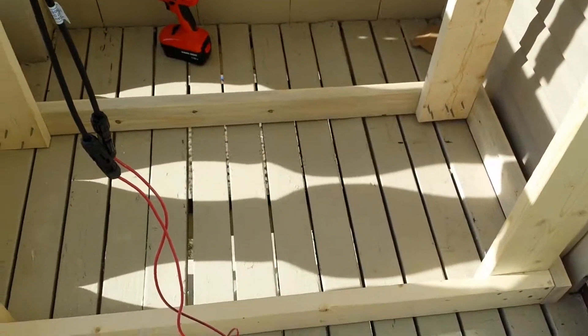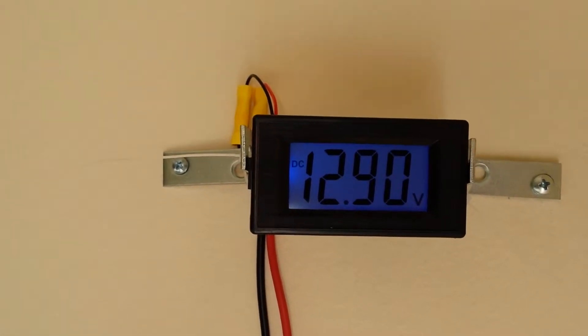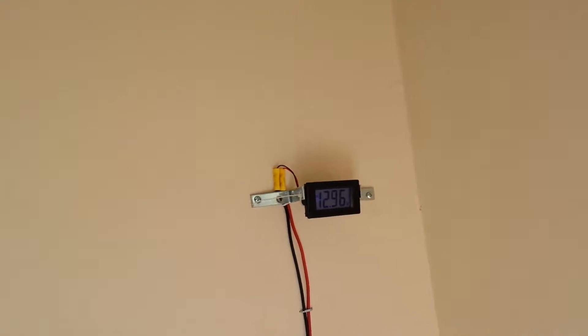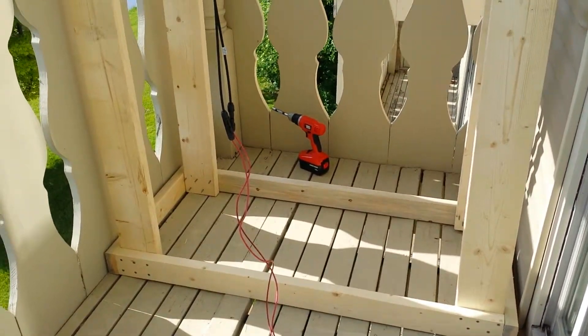That's how I did it — utilizing basically what I had and making a stand out of it. I've got my fan plugged into my inverter right now and you can see it's holding pretty steady at about 13 volts, pulling about 130 watts out of that fan — not quite enough from the solar panel alone to power the fan, but that's fine with the battery. This is how you install solar panels in an apartment complex without being on the roof.